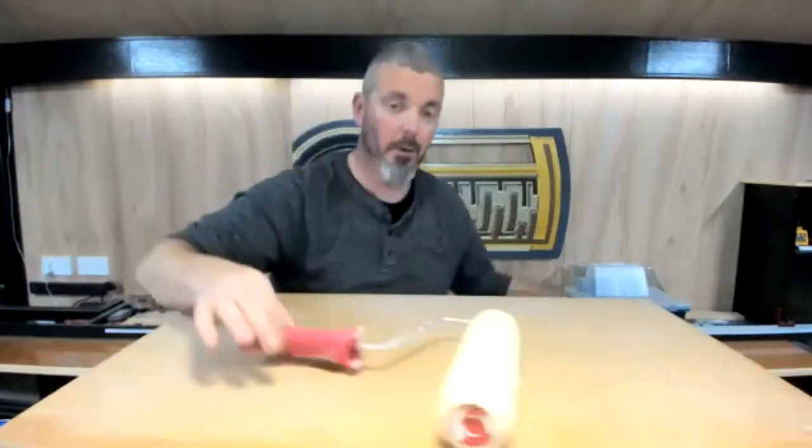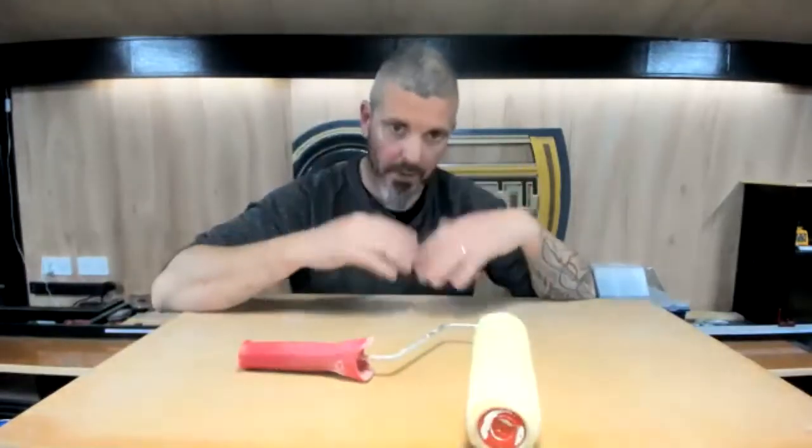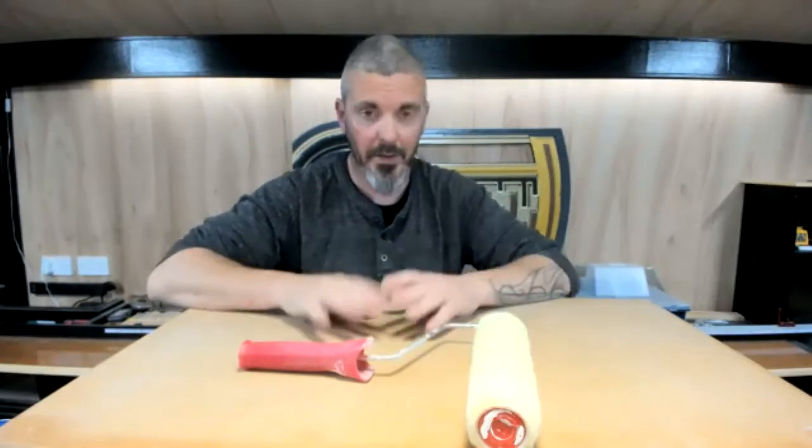And then I'll always come back at the end, literally holding my roller with two fingers. I'm not using force here. And I rub over every single bit of the wall all over again. That really does make everything nice and wet at the same time, and it just dries nicely, and it's a much, much nicer finish. Again, personally, it's always the way I've approached it.